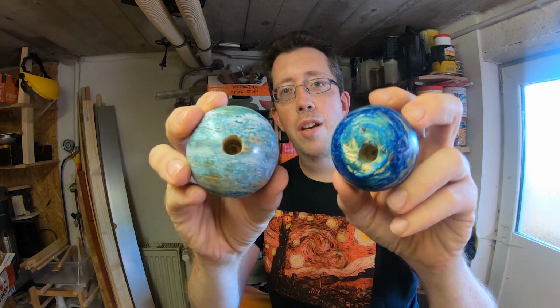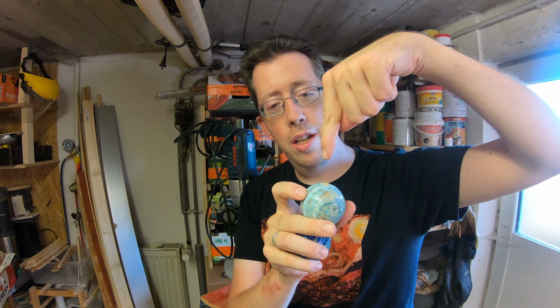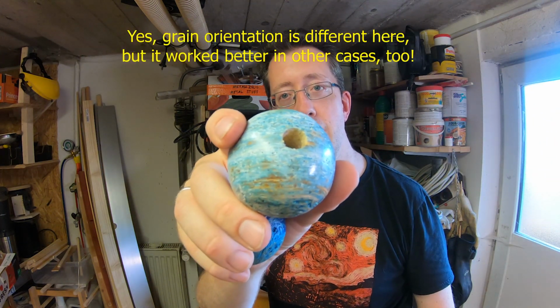For comparison, what I did differently was I didn't just go in with a drill, I used a brad point bit. With this one I just went in there, and OSB isn't the most, well, laterally sturdy material, so I got a lot of tear out. Pretty much the whole pole there. Here, I didn't go straight in. I put the spur in for registration, and then I angled the bit like this, so the corners on the side would actually scribe a circle, and then I went in. That left me with a clean edge and a nice hole.